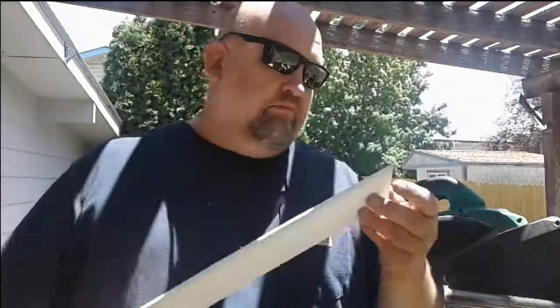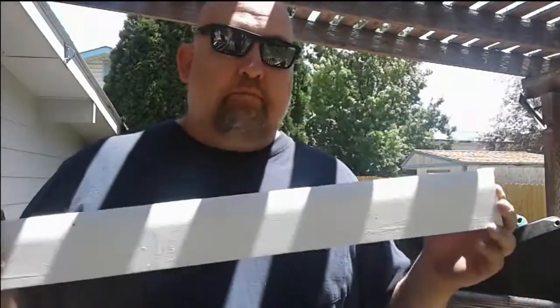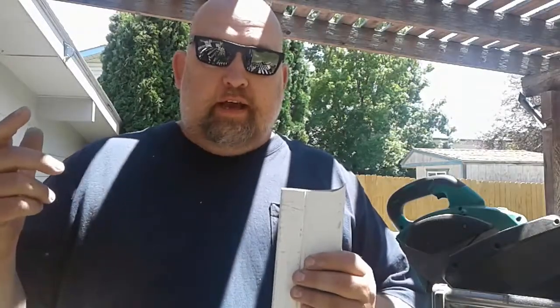So he actually used a grinder on MDF, like I said when I went to part of the video at Lowe's. Don't buy MDF if you don't have to. It's crap. Plus, it's not good to breathe in when you're sawing it, especially a lot of it, because it has formaldehyde in it. So you should have a respirator on and glasses or something that covers your eyes as well when you're doing it. Wood's probably not the best thing either, to be soaking into your lungs, but I'm old. I can deal with it by now.